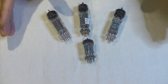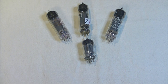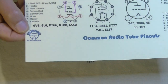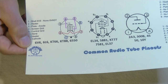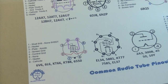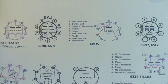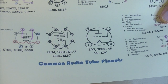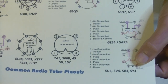When a base type is the same, it is much more than just another 9-pin miniature — every electrical connection is identical. Let's take a quick look at a pinout sheet available on Blue Glow's website. Dave has a great website filled with all kinds of good tube information, and an amazing series of YouTube videos. The 9A covers the 12AX7 and the whole series including the E80CC, and he also covers other common tubes: the 9AJ, the 6SN7, the octal voltage amplifier similar to the 12AU7, common power tubes like the KT88 and EL34, and common rectifier tubes.